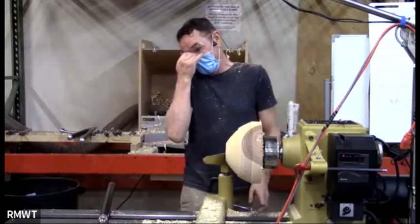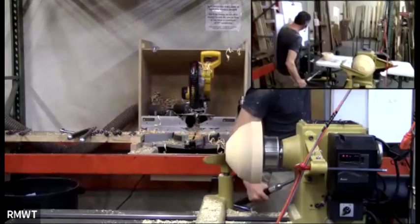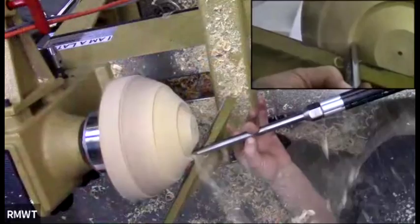So the secret to doing this is, make sure you've got the sharp grind right. Relatively straight wings, 40 degrees, gives me a slice and a peel. If I go part of the way around, you'll see what I'm doing. I'm slicing with the nose, peeling. It's tracking by itself. I'm making it stable at the front. If I stop,